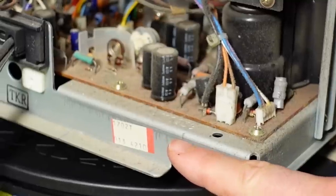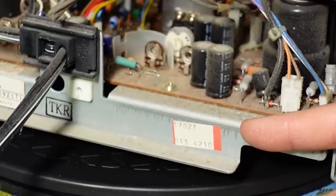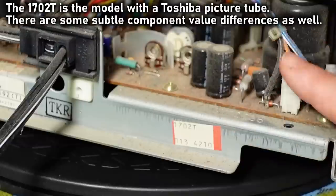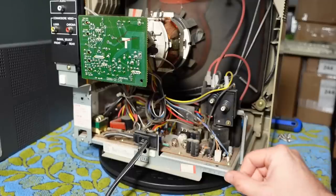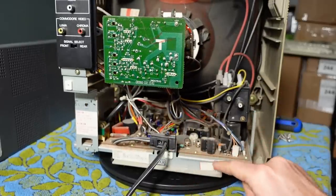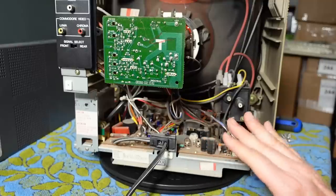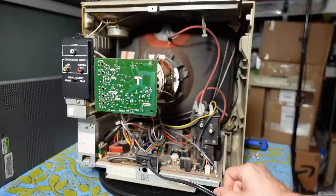We have some warning stickers in here, and one says: 'High voltage is not adjustable. Normally high voltage is 22 to 24 kV.' What generates all that high voltage is the flyback transformer right here, and that comes through this high voltage cable into the CRT. The CRT is like a giant capacitor, with that connection being the anode. There's actually another little tidbit about the 1702: there are actually two versions — the 1702 regular and the 1702T — and this appears to be the 1702T. I assume there's just some subtle changes on the PCB between those two revisions.